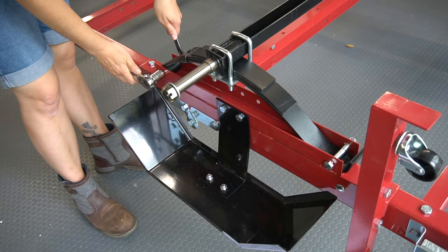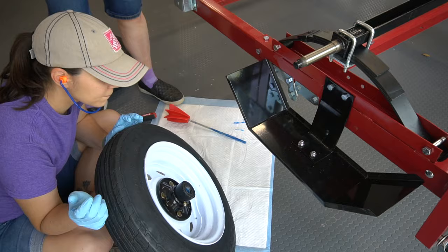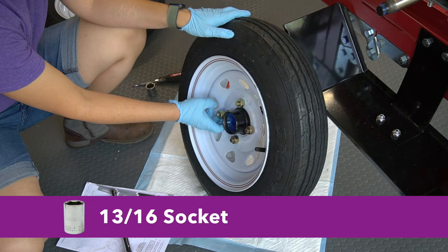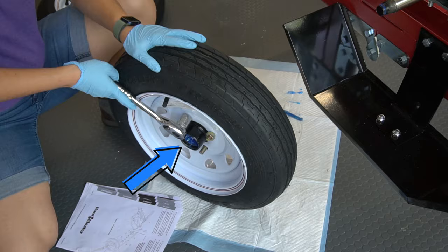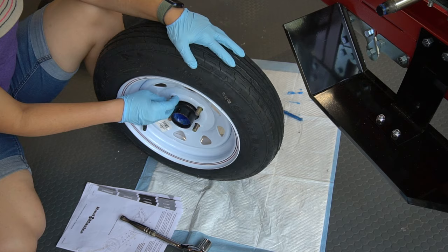There's a dust cap on the front of the wheels that needs to be removed. We stuck a metal rod through the backside to pop out the dust cap from the front, then removed the hub assembly from the wheel. I didn't have a metric socket big enough, but a 13/16 socket worked. One note: I've seen conflicting information about the grease that comes on the bearings. Some say it's shipping grease that must be fully removed and replaced; some say it's sufficient. The manual indicates it's sufficient, and Steven confirmed, so I didn't add extra grease.